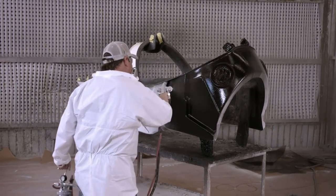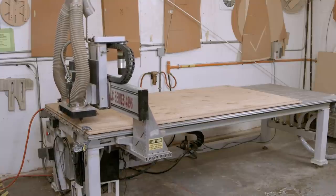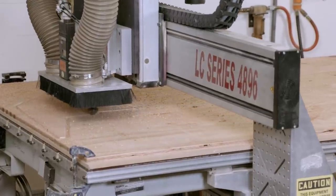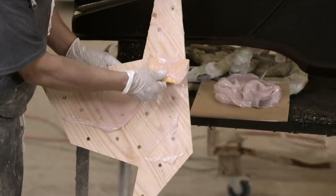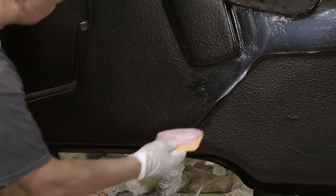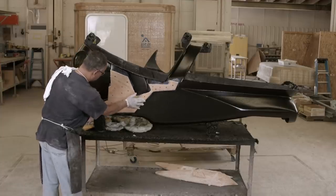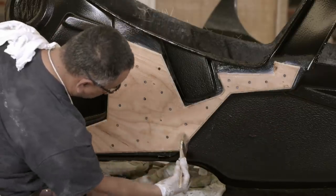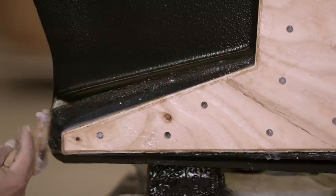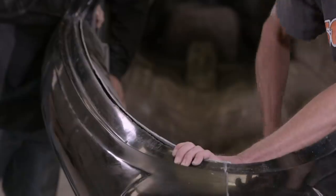To make the diving watercraft's passenger cabin, gel coat is sprayed onto a form, which is then covered with fibreglass. A computer-driven router then carves into marine-grade plywood to produce structural backing for the sides of the cockpit. The part is then coated with an adhesive, as is the outside of the fibreglass cockpit. The plywood piece is pressed into the glued areas of the cockpit, after which resin is brushed onto the front of the plywood. The cockpit section is cut in two, and both parts are glued to the inside of the main body.